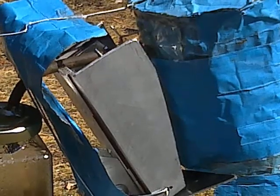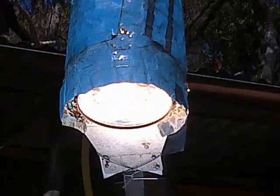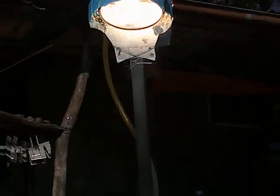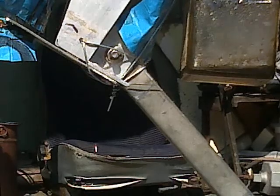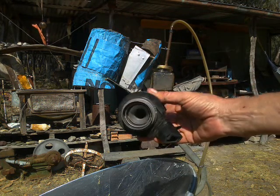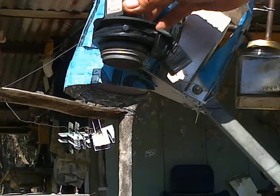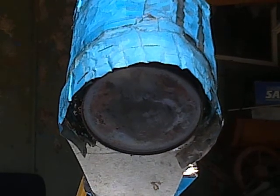The distinguishing feature between the Mark 1E and the Mark 1F is this bracket, made out of aluminium, fabricated to precisely align the bottom of the gasification canister with the focal plane of the dish, as referenced by the black line of marking pen ink, which shows where the original microwave guide used to go, as you can see with this superimposition.